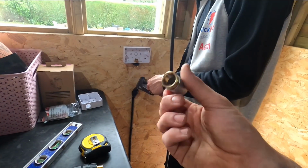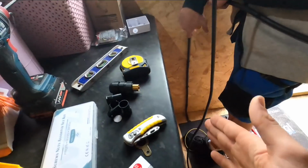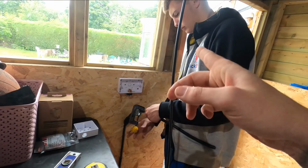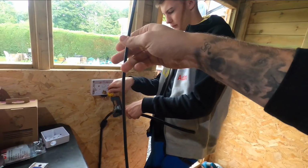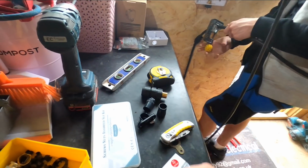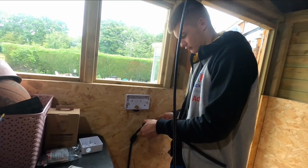We were originally going to use bush and coupler metal ones, but because I want the switch directly above this little groove here, where the armour came out the floor, I'm not pointing at you, mate, I'm pointing at that bit, so I can get a stuffing gland straight up to bring the flex down to. So we're going to use a bit of solid conduit, don't worry guys, Christ. I think we'll do. Yeah.